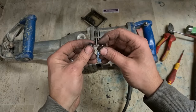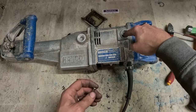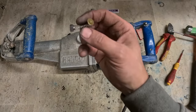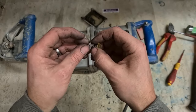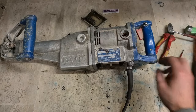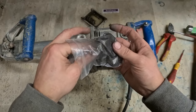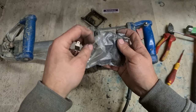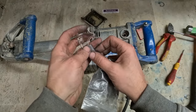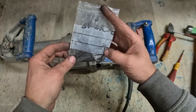Spring's the problem. When they get this long a spring, they generally have a fatter spring as well. Once you go fatter, it won't fit inside the hole. So we need something like this with this size of spring. It's long enough and thin enough and roughly the same size of a brush. And these might do. These are old brushes as well. These are old Ryobi brushes.